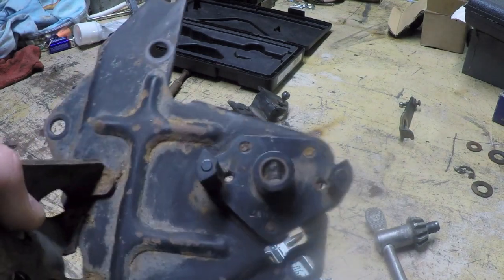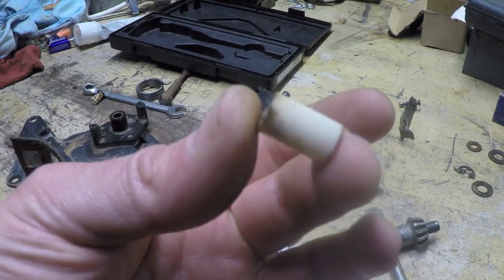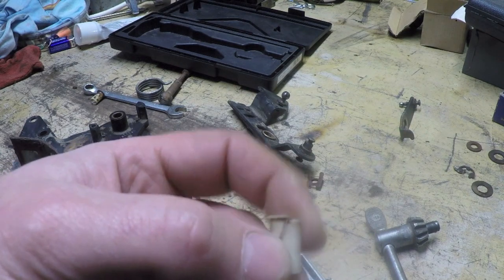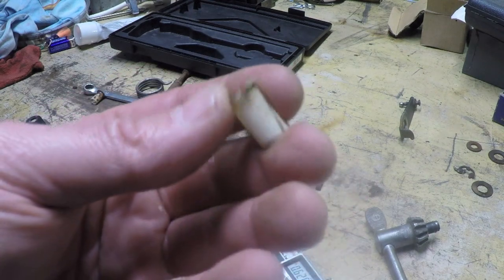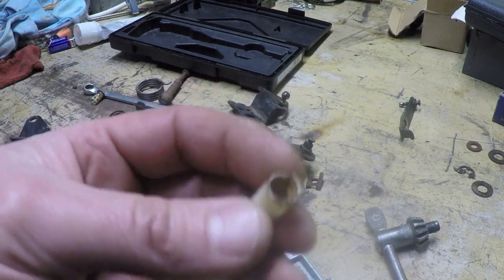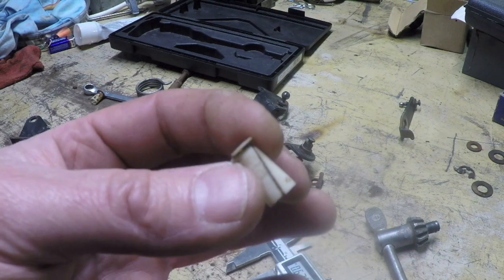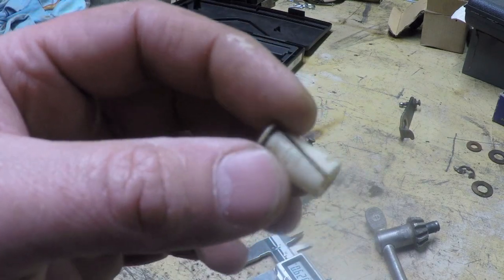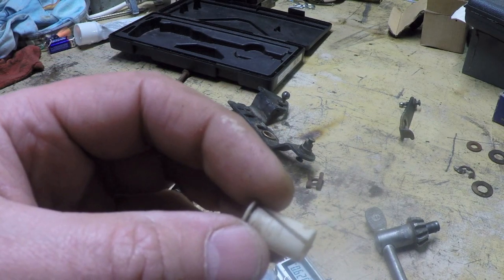All I need to know: 3/8 bore for this to slide into, 5/16 shaft diameter, and the length between my two fingers is 5/8 inches. I could probably go a little bit shorter and it would be okay. The thing that's throwing me is this slit right in this bearing — that makes it what's called a clip bearing as opposed to a regular flange sleeve. So if this slot wasn't here and the flange is here, it's a flange bearing. If the flange isn't there and it's just the sleeve, it's a sleeve bearing. Because it's got that slit, it's a clip bearing.